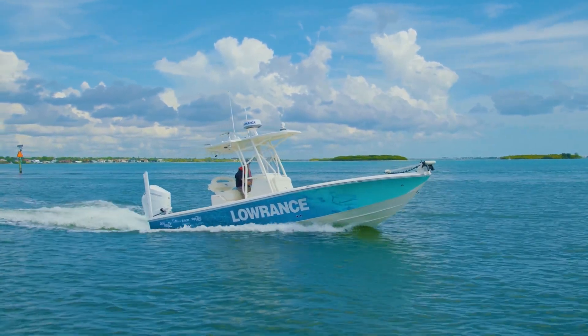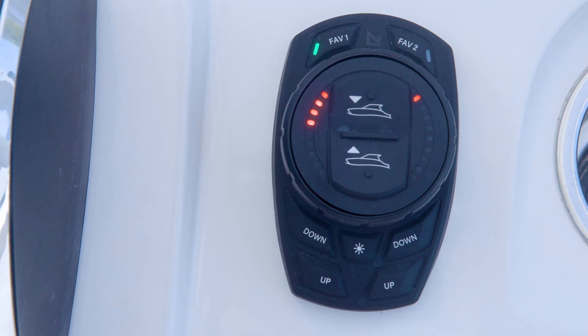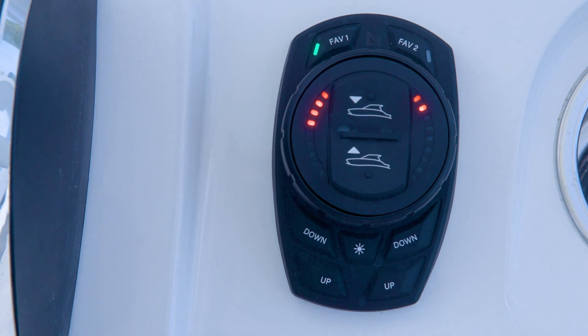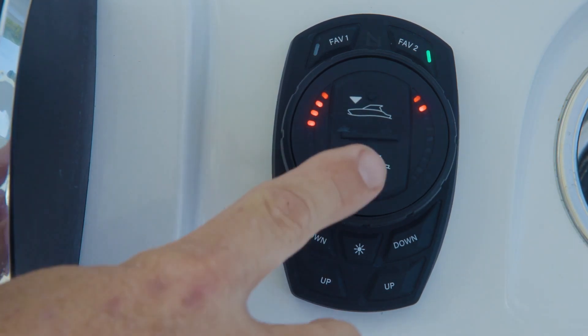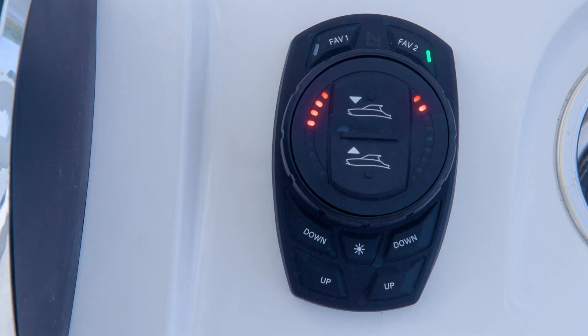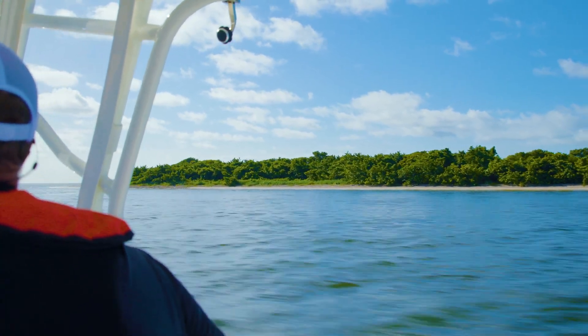Turn the dial counter-clockwise again and release. The third left-hand LED will flash to indicate the system is commissioning the actuators. The right-hand LEDs correspond to the number of actuators installed in the ProControl Assist system. The maximum number of allowable actuators is four — up to two port and two starboard. Using the pitch up and down buttons in the center of the dial face, select the correct number of actuators installed in the system. Next, long press the DIM button to auto-locate the actuators. Actuators are only to be connected over the Lenco 2K network, not the vessel's global NMEA 2000 network.